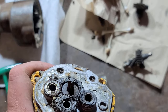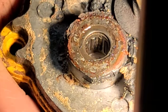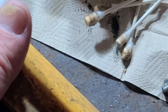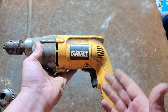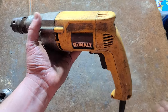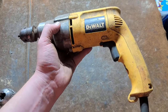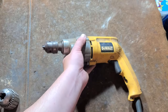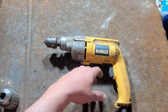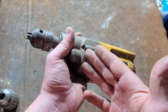Due to the nature of it being a drill, it's not going to be the end of the world if this particular bearing isn't perfect. After cleaning, I actually got it to shine up pretty well — that's going to be just fine for a beater drill. So after all that work it still looks pretty beat up, but the power cord has been replaced — I'll eventually re-replace it with a 16 gauge. Brushes were good. Looking in that gearbox, it didn't just need new grease — somehow water had seeped in around the gaskets. When it gets left outside, heats up, slight air expansion, gets rained on — static water sits along the seam, the gearbox cools, creates a vacuum, and actually sucks in some water. These are relatively well sealed with seal bearings on the front and back.